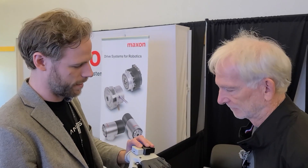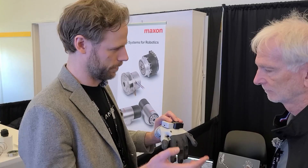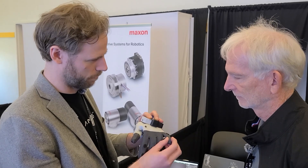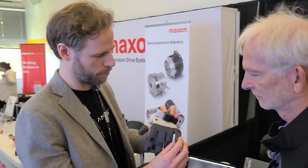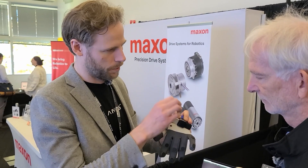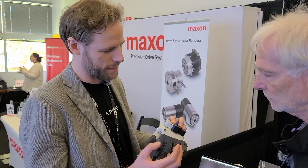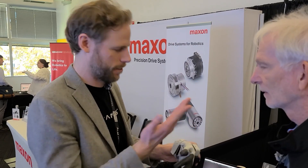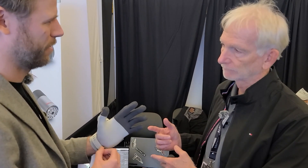Thank you for the episode — it was really fun to see you pick apart the rationale of how things work. What makes our gloves unique is that instead of using IMUs, bend sensors, or stretch sensors, we create an electromagnetic field. There's a source that sits in the glove and passive sensors on the fingertips. We measure in absolute space where the tip of each finger is — both position and rotation — in relation to the base unit. Because fingers are totally deterministic, if we know position and rotation, we can calculate backwards using inverse kinematics what the rest of the hand is doing. It's essentially a GPS system for the fingertips.